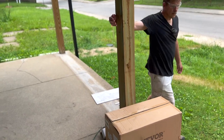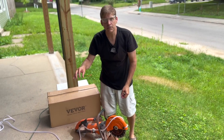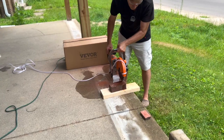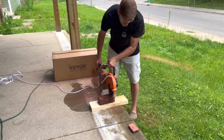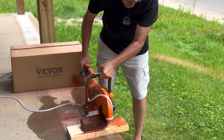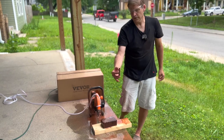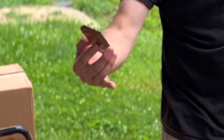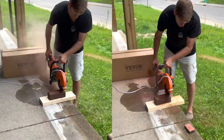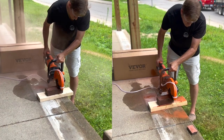It wasn't pumping immediately — I was just messing with it. It goes from a high-pitched whine to a low tone once it starts working, and obviously you can see the water coming out there. Let's cut this with water. It can really give you a sliver of a brick, which I really like. It's all about the blade — the blade is good and sharp. Goes through that like butter. You can see the water made an amazing difference — it stopped a big cloud of cutting dust, and so that's always a plus.